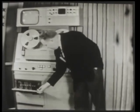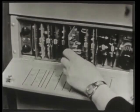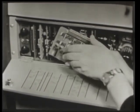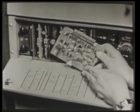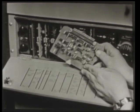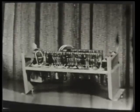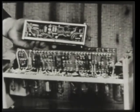Now let's look at the signal system in the VR-1100. Like all components, it's completely transistorized. The body of each circuit board is epoxy fiberglass — it fully meets official military specifications and represents the most modern practice for advanced electronic design. These boards are used throughout the VR-1100 because it's a proven better way of doing it, and wherever possible they are interchangeable, which is a great advantage when checking and troubleshooting. Compare this simple, clean board with the old-fashioned vacuum tube or hand-wired technique, with its high failure potential and difficulties with solder joints and lead dress.